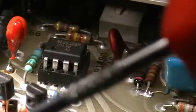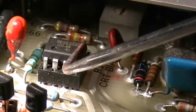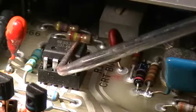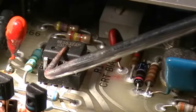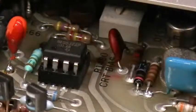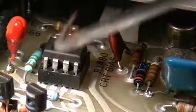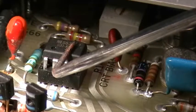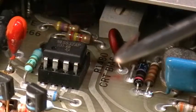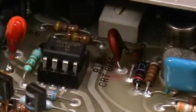The failure of that chip really had me a little bit to figure out what was going on. Because the positive supply, which wasn't even related to the supply that this one operates, was acting like the output was shorted. But the problem was the output of this had shorted positive, which was causing the transistor it's connected to - I forget which one it is, it's been a while - to come to full saturation. It was pulling down the output of a totally unrelated supply. So that one caused me a little bit of consternation.